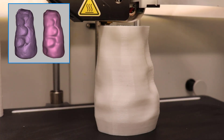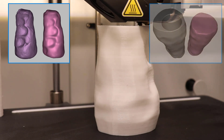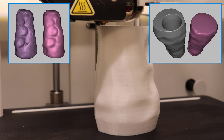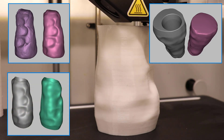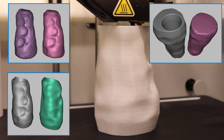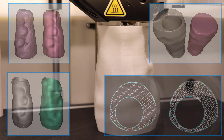To recap all the points we've discussed: we will want to smooth our mesh as much as possible to reduce cracks, sharp edges, and non-manifold areas prior to any CAD or mesh export. We want to have a flat bottom on our scanned mold so that we can properly place it on a print bed, which can be done using parametric modeling tools or by modifying the mesh. We want to export the mesh with decent mesh quality so it doesn't become pixelated during export and affect the final quality in the printing software. Finally, we will want an infill and wall thickness setting that maintains surface quality but is still flexible enough for our needs.